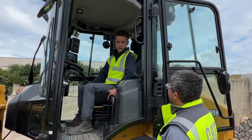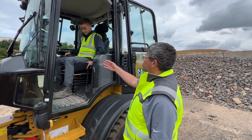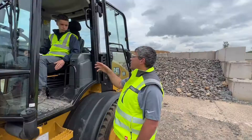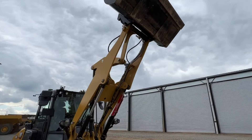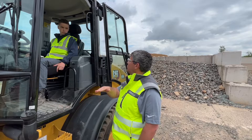That is really interesting, but I'm sure this is a new feature — usually the arms are separate to the seat. That's right, if you just bounce up and down on that seat, the joystick controls are now mounted to the seat base, much like our larger wheel loaders, which means you're in control and your arm is ergonomically positioned so you can be comfortable all day. Inside the cab there are three buttons just down there to the right hand side — you can set the position of the bucket to the ground or up high, change the angle, set that position, and repeat it just by the press of a button. Which means you're not going to hit the cutting edge on the ground and scrape it along, so you save that cutting edge.